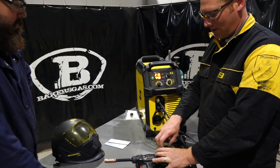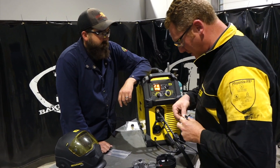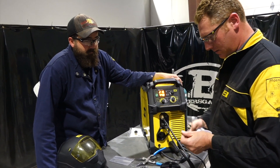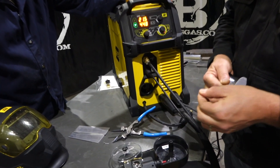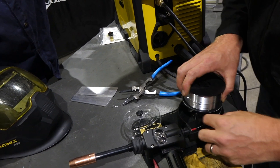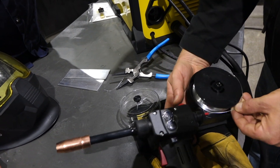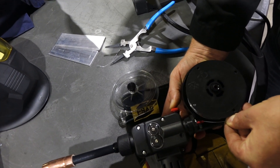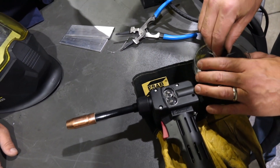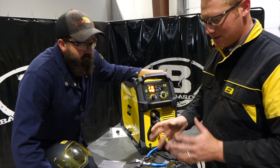Next step is we got to get the wire in here. It can be a little tedious, but that's kind of the truth with any spool gun. What we're going to do is just make sure we clip the wire and try to straighten it a little bit — it'll help you out. I want the wire to feed off the bottom. This is different than competitor spool guns — they feed off the top, which is a little bit tougher to feed when you're trying to set up. So now the wire's at the back of the drive roll — this takes the tension off the rollers. Let's put this back on because this actually adds tension to the spool to keep it from unraveling. 5356 tends to have a little bit more spring to it; 4043 is more of a softer wire.